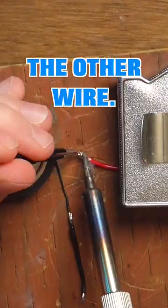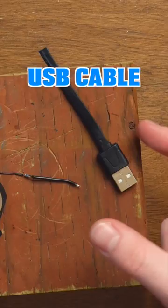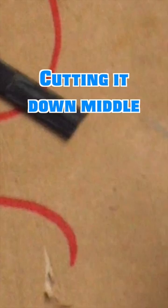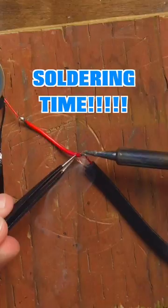Repeat with the other side — now the wires for the CD player are slightly longer. Now for the USB cable part, because yes, this thing does work via USB. One of these flat USB cables are ideal because they have two wires in them on either side. I just cut down the middle of the wire, then stripped the two sides that were cut, and then there's two wires poking out of that USB cable. And now I soldered those wires to the USB cable wires.